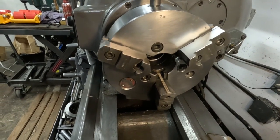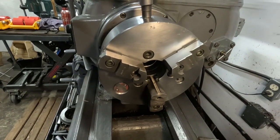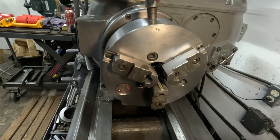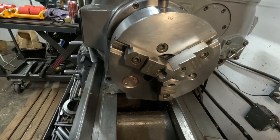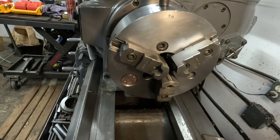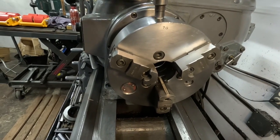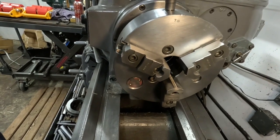Plus the scroll itself gets lubricated. Go ahead and wind it all the way. Here's a tip I picked up that I think goes for everything: a lot of times you're better off fully opening and fully closing a chuck. And also on machine tools, move the slides — roll the carriage back and forth on the lathe and the cross slide.